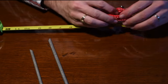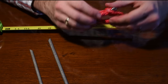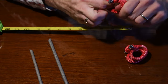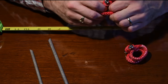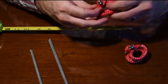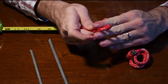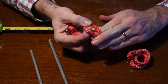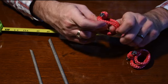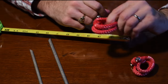And then we have our little tiny soft shackle, which when we measure it is just shy of two inches inside — the internal diameter. When this gets fully loaded and stressed, it'll stretch just that last little bit and be two inches of internal diameter, which is the same size as a bronze hank. This means it can be a direct replacement: you slip this thin little section through the grommet of the sail where your bronze hank is, it comes out on the other side, you wrap it around the stay, hook it on, and now your sail is attached to your stay with a soft hank.